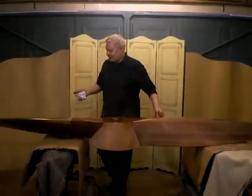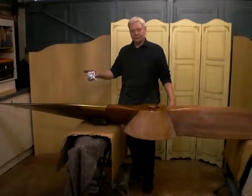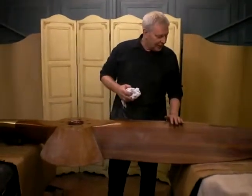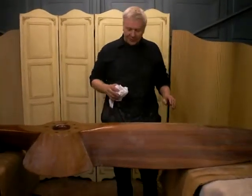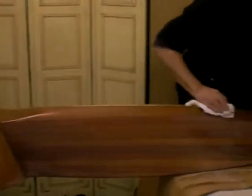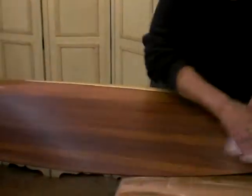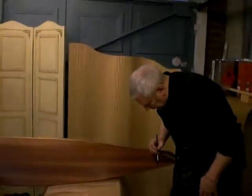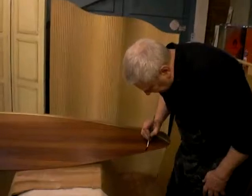I've already given this side two coats. I'm about to coat this one — I'll show you how we do that. It's been sanded down, really flattened in between coats, get all the dust off. We've got some filling on the edges to do, which I've done and sanded down, so I've got a fairly good base colour. The base colour was right, so all I really need to do is just a little bit of grain in these bits here, just along this edge.